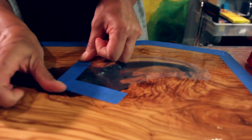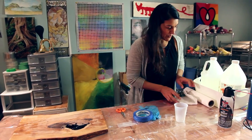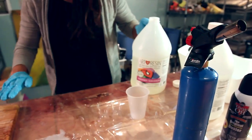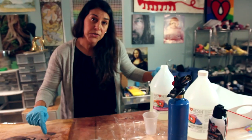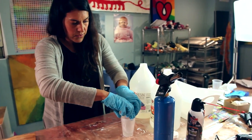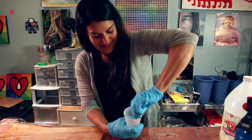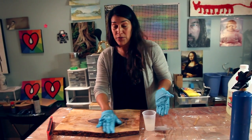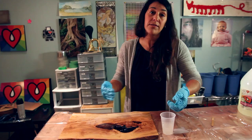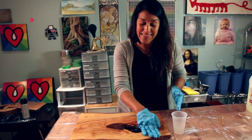I'm just going to tape this on, flip it, and give it a quick spray with the dust spray. I've got my resin in its baby bath — I'm going to do a little more than a shot glass of each because I need enough for a gloved-hand coat on top plus the first base layer in the hole. Stirring for three minutes, scraping bottoms and sides. I've stirred the art resin and I'm ready to do a very thin coat with my gloved fingers — it's totally normal to sand and resin a few times with a natural material like wood.